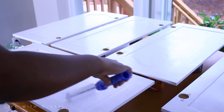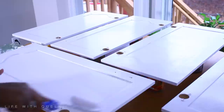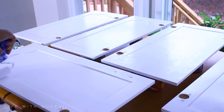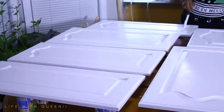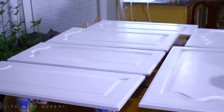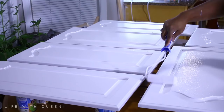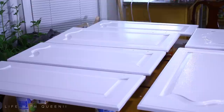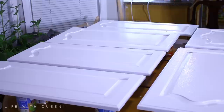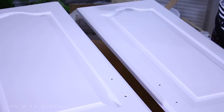The process for painting the cabinet doors took about six hours, and that includes the waiting time for each coat to dry. I used the foam roller to do the sides of the door as well, and again you can use canned goods to elevate your cabinet doors. Paint one side, make sure it's 100% dry before you turn it over. If you're not 100% sure, just let it dry — the canned goods can get stuck onto the door and mess up the look, leaving a circle impression.